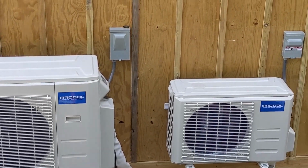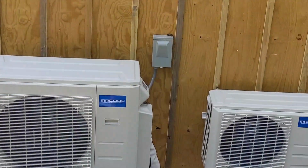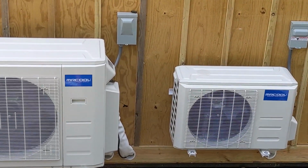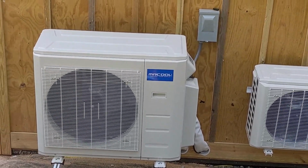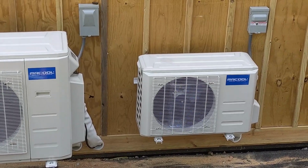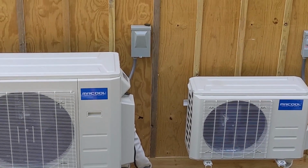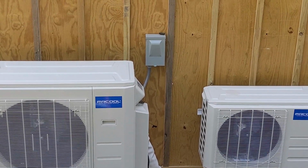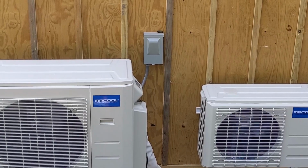All right, we're wrapping up our install of the two Mr. Cool units. We did set them on brackets. This area, all the water comes here. We did put a French drain in. We just didn't want to set them on the ground, so we wall mounted them on brackets. This is a 440 pound bracket. That's a 176 pound bracket. And on the other side of the house is the 36,000 BTU or 3-ton unit you saw in a previous video. I'll put the link in the description to that one.